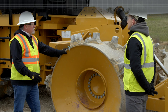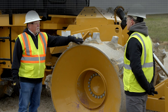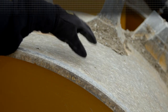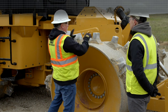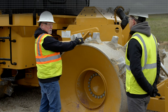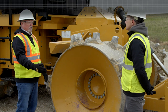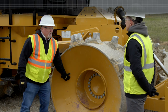The other option is you can remove the tips yourself — they're only welded on the front and rear. You remove the old tip, get the new tip, and clock it. The surface between the tips is worn down, so you take a new tip and put it on the old surface, rotating it so you have a brand new surface that was protected, and the new tip then protects the worn surface. When the second life tip wears out, you have an evenly worn skin, and it's time to replace just the skin — keeping the core again.